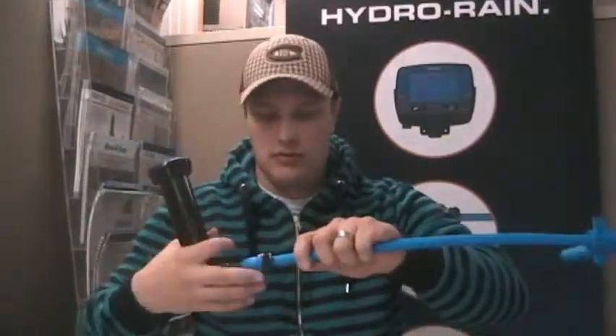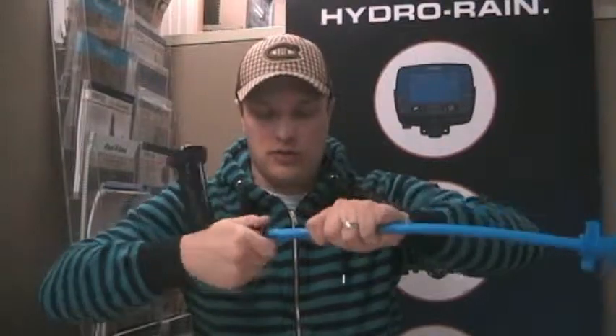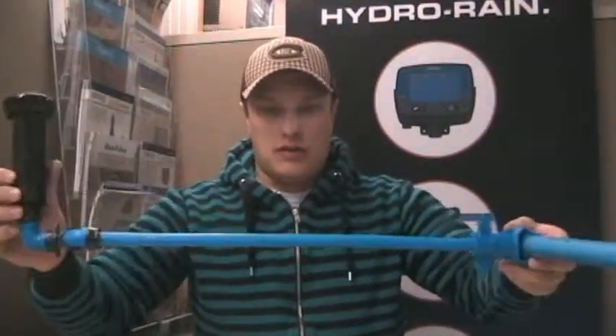Using a combination of street elbows allows you to adjust the head this way and that way, just for making sure you can get that sprinkler head set in the right way. You just push in and push together those fittings — the half inch fittings push together really easily. So that's the BlueLock Nitro Saddles: a nice option if you're pulling in pipe for sure, and some guys are really liking it. It's another thing from Hydro Rain and BlueLock that makes irrigation installation that much faster.